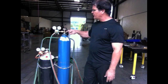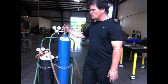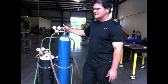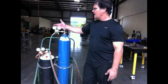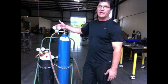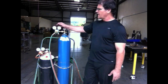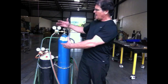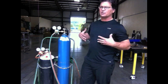There is a phenomenon called the heat of recompression. If there's already pressure in the regulator and you shoot a bunch more pressure in there, the temperature spikes momentarily. All it takes is a speck of dust or a little oil — anything in there becomes fuel — and you get a regulator burnout, RBO. If you don't believe me, Google 'RBO OSHA incident' or 'regulator burnout.' People have been seriously injured; oxygen saturates clothing and causes bad burns on the torso and worse.